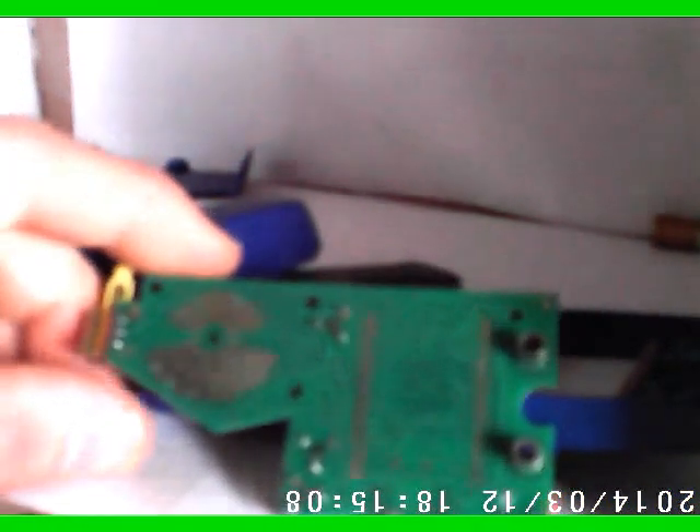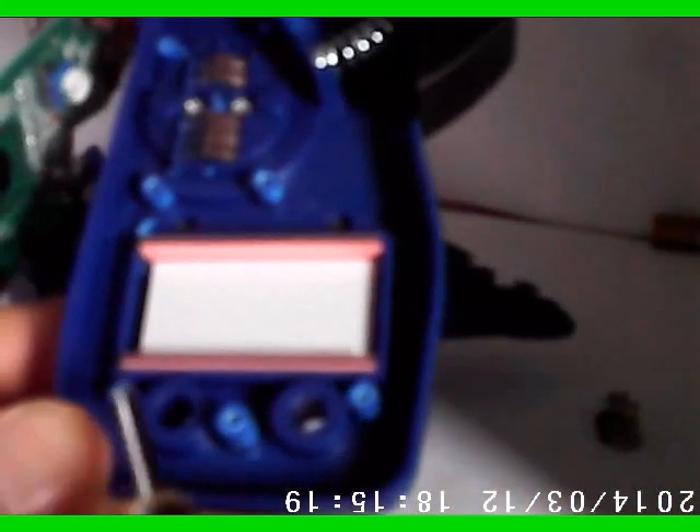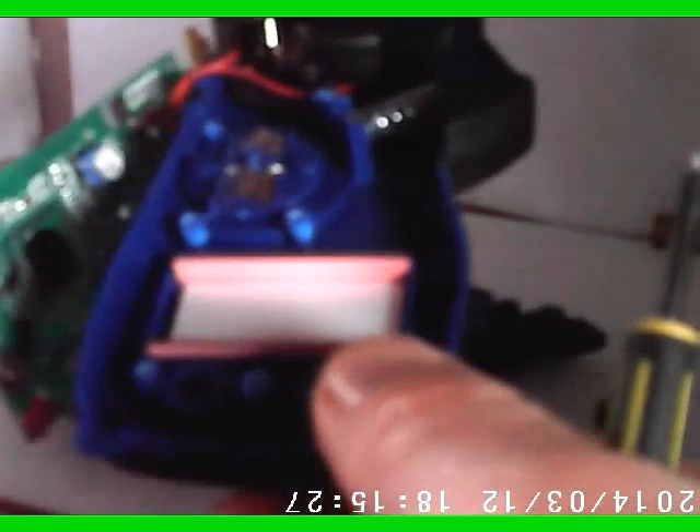I think what I'll do is solder this connection here and see if it helps either the voltage or the amperage range work a little bit more. I'll take a peek at the display unit and see it's got the old what they call zebra strips, which look pretty good — not marked up, no debris or anything on them. The contacts on this side also look nice and clean. I'll use a piece of cloth and rub those down to make sure they're nice and clean. I'll get the soldering iron out and be right back.